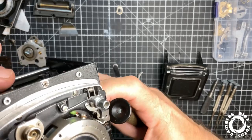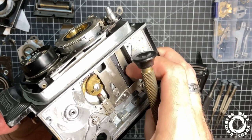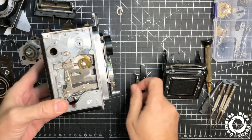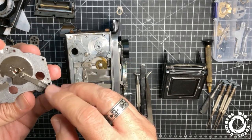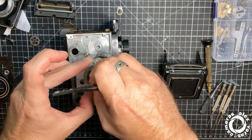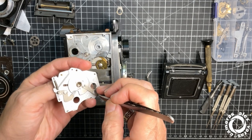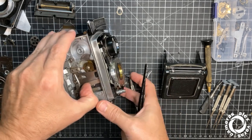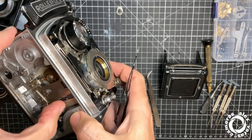Now, maybe this one is already moving. So this is the first connection you need. So again, explaining how the winding cocks the shutter. This small plate has this lever that you put into this one, and the movement you do is this one. You rotate. So that rotation, imagine that you have this fixed position here, will make this go in this movement. So it's going to move this lever up and down. And this way you are already cocking the shutter. It's already cocked.